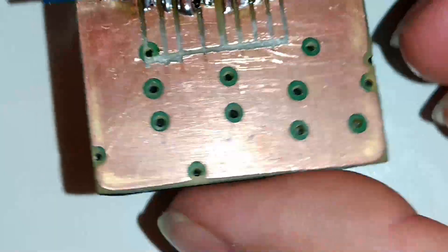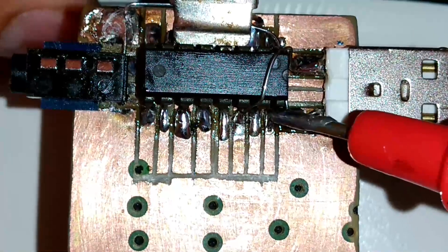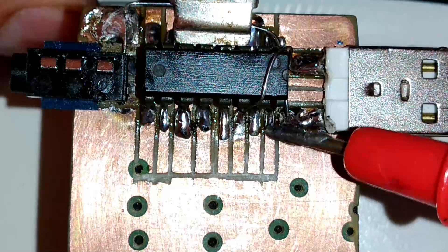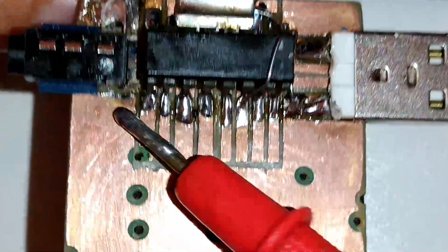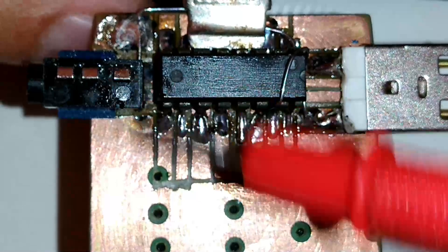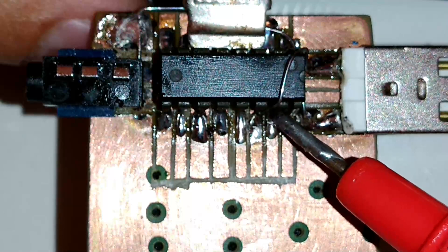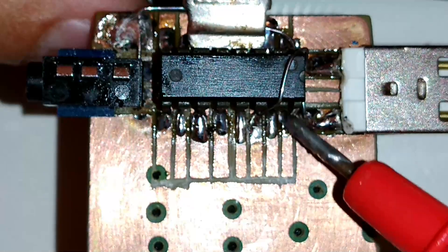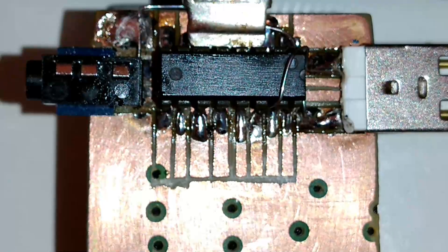This side is concluded. Now we will pass to the audio of the P2 — P2 positive. The last one here is RL, because it is mono. We can push directly to the RL, or solder here on top, which will be easier. The number 16 is the audio positive. The number 15 is the GND of the audio, but as we can push the GND directly, there is no problem.